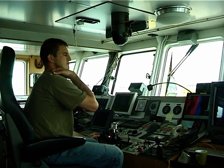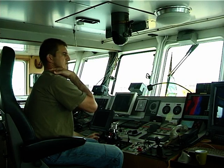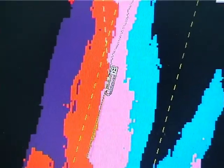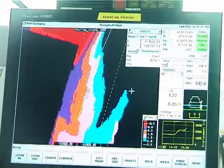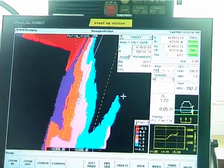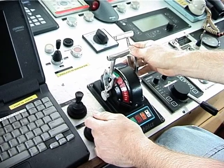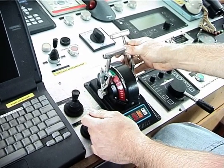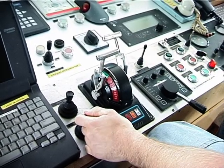The bridge of the Saucepan is very sophisticated, and the dredging operation can be controlled by one man. Computer screens and satellite navigation systems enable the track of the dredger to be carefully controlled in relation to previous surveys of the seabed, which show the location of available material. As material is dredged, the track is recorded with the survey data to avoid revisiting areas previously dredged.